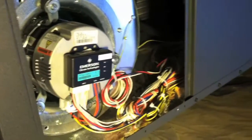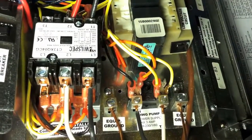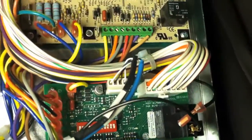Opening up the blower section, here's the backside of the coils, the condensate pan, and the variable-speed blower — high-quality equipment that does a great job. I've got the other end opened up to show where the electrical connections are made. Here's where the heat pump power supply goes in. The HWG pump — hot water generator — I haven't installed the plumbing for that yet, but it also provides power to the flow center and switches the pump on automatically. The brown wire is the thermostat; it runs around the front of the unit and connects to the front of the control board. Those red and white dip switches you may need to adjust based on how you have the unit set up.